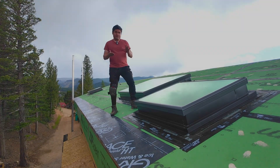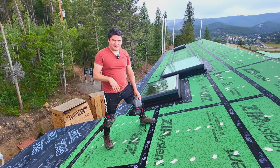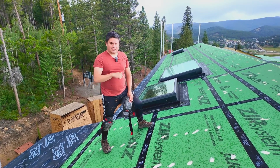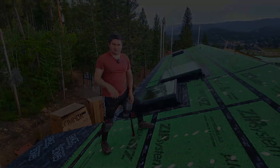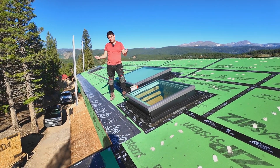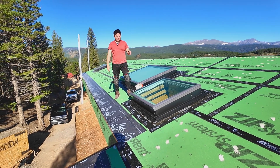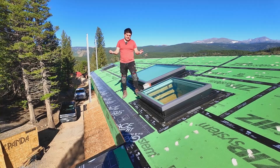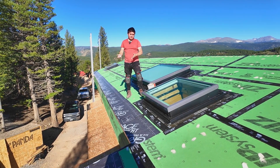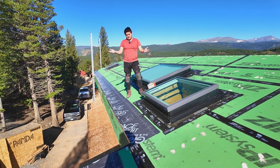I was about to explain how we install this, but we have a little bit of rain and actually a little bit of lightning, so we have to run off the roof. It's the next day — it's nice and sunny, the roof is dry, which is very important. When working on the roof, it's important to work in dry conditions. Safety is the most important thing — nothing matters more than that. And for application, it's also very important that the roof is dry; you don't want to be applying the ice and water shield when it's wet.